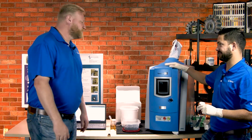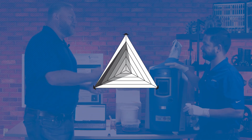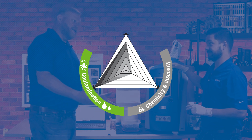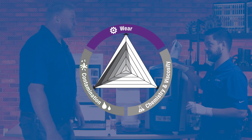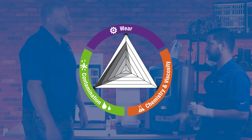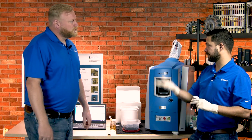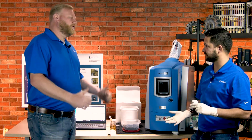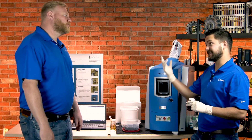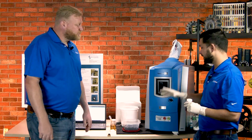You know about the elemental data — when we think about oil analysis, we think about the iron triangle: lubricant health or condition, the contaminants that may be getting into our lubricant, as well as wear debris generation. These three categories are very important and appear across every single oil analysis report — it's kind of the backbone. We want to watch the trends of possible wear debris increasing or contaminants on the rise, and we can also trend the downward trend of the additives in the oil. There are a lot of different opportunities here.